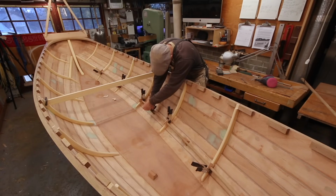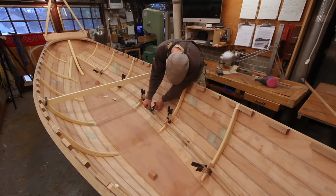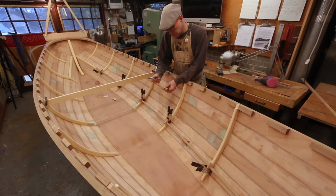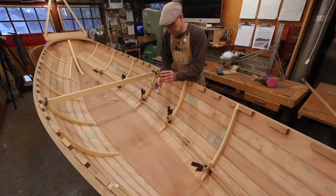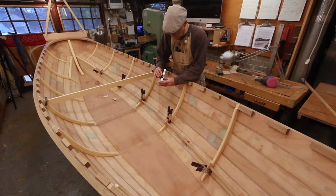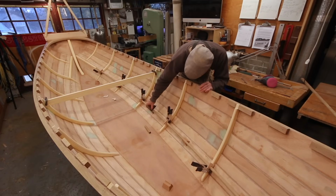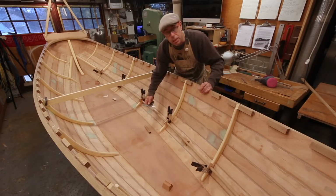I'm just taking my miter square, my combination square, drop it on top of my rail there, and that's giving me a height. So with that height, I take one of my blank blocks here, drop a piece of dowel on there, drop my square on top of that, and then mark the bottom of it for the height of my finished block. So let's go through making one of those right now. So we've picked up our height here on this. Now let's go cut a block out.